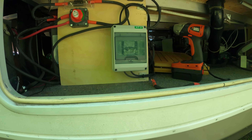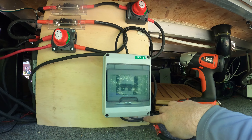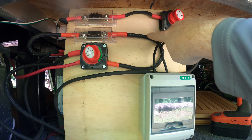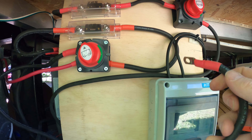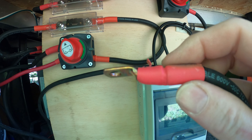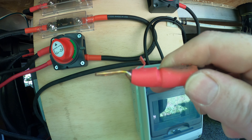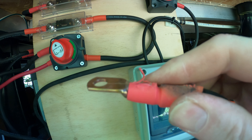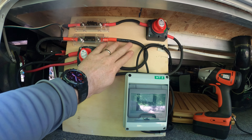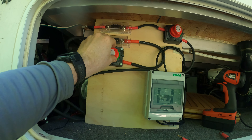Check this out — this is where we sit and I'm pretty happy with this. I ran out of cable anchors for my cabling, so I'll anchor it in two places here. I made a whole new cable with a more suitable bend radius. I tried to cut apart the old one to see if my solder joints were bad — well, that was burned. This heat shrink is so good, it's got the gooey glue on the inside and I can't get it off — it literally comes off in tiny pieces. I just made a brand new cable, a little bit longer with a nicer, more suitable bend radius for number two welding wire.